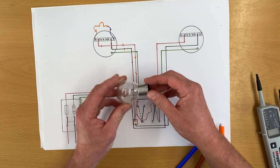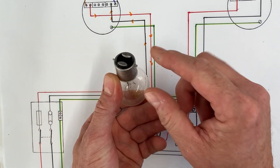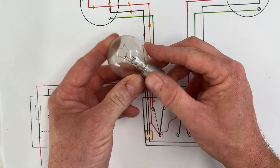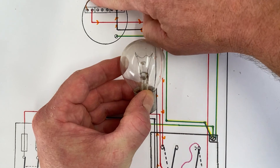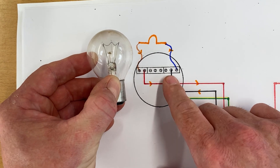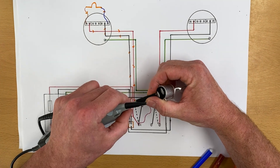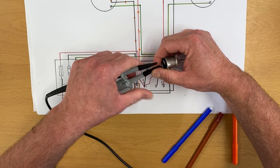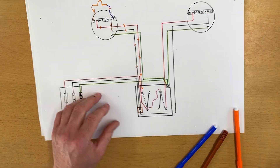If I bring an old tungsten filament lamp in here — we've got the two stalks connected to it; neutral and switching line, no polarity issue, it's a bayonet cap lamp. That filament wire is connected across the two points, therefore connecting together our switching line and neutral. We can prove that by probing onto the back of the lamp holder — we get a beep, confirming there's a continuity loop through the filament wire. Hence when testing between neutral and switching line: no voltage, but a continuity beep.